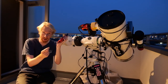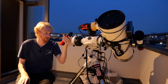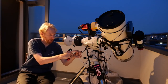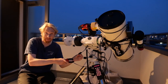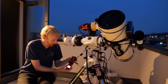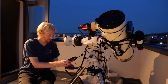This particular tool cost me around 30 bucks, which was good because I needed a multimeter anyway — it has multimeter functions as well. I can set it to 60 amps. It has backlighting, which is nice. For the power cable of my mount, which is DC, I split it into two, because if you measure both wires at once, one side is positive and the other negative and they cancel out. So you have to put just one cable through the center of the clamp.